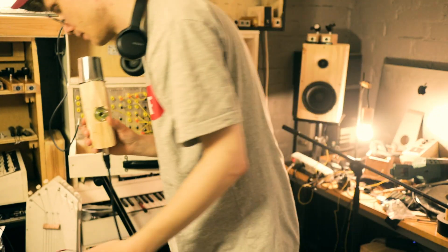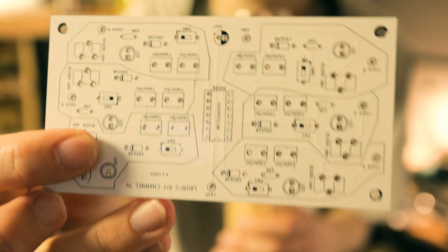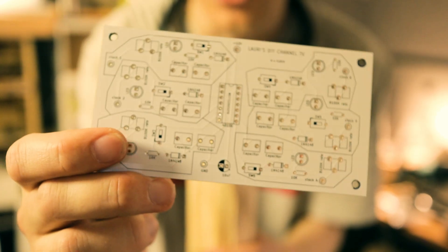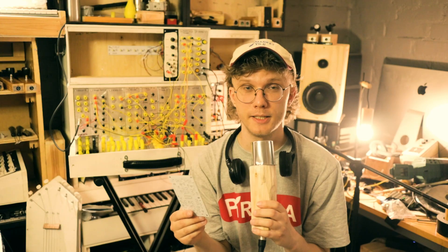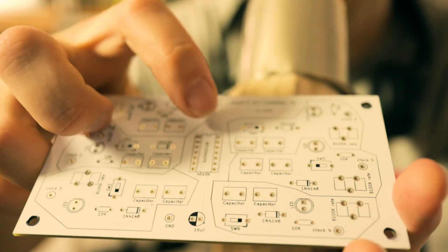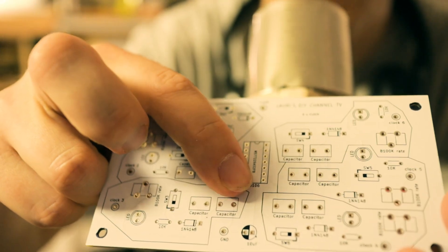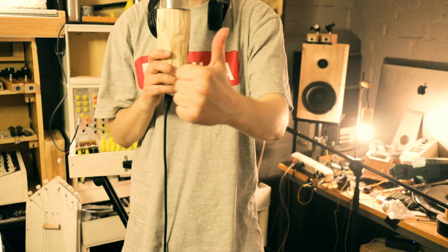Here's one — it's not a great design but it's a design. There are six oscillators in one board, but you don't have to build all of them. I, for example, built only four in my module. I did forget to add a decoupling capacitor for the IC chip, and I do recommend adding one, because that helps with some bleeding of the oscillators to the power rails and then the whole system and eventually your output. That's a very simple fix — just solder a cap from the power input of the IC to ground and keep the cap close to the IC chip.